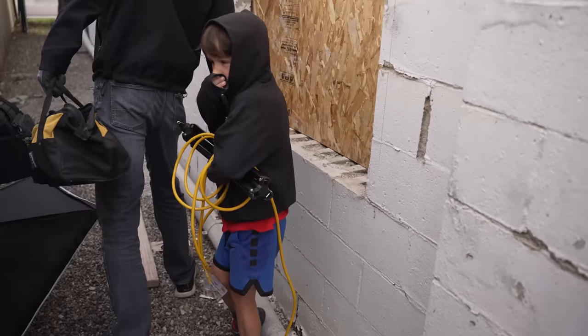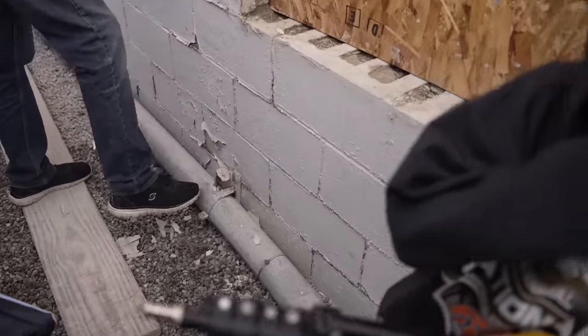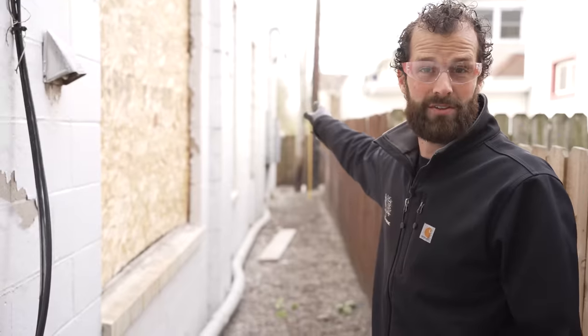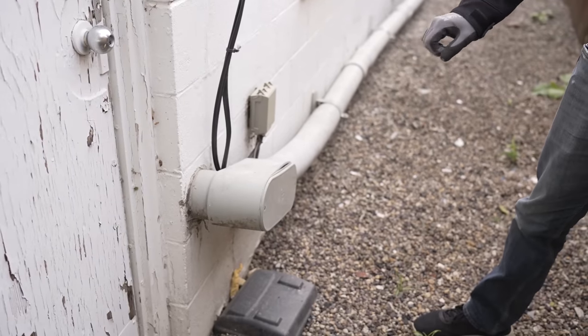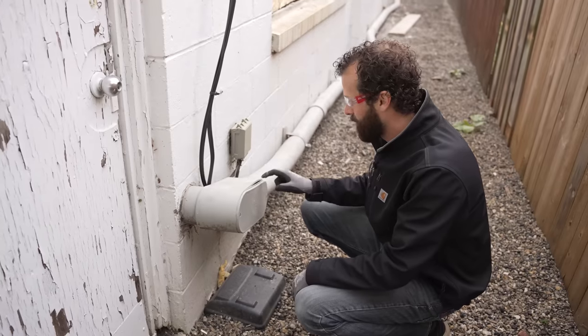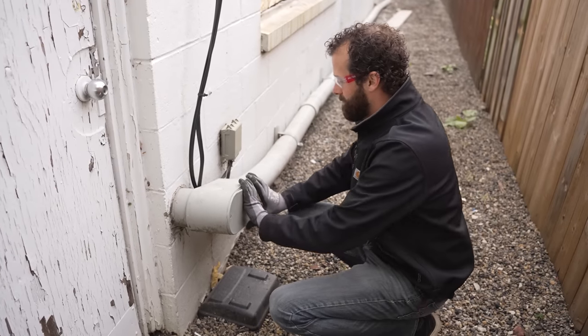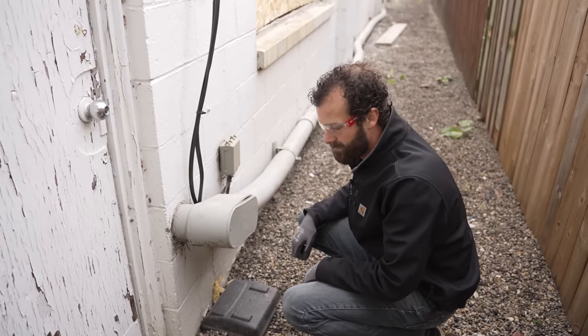Look, they had a tree growing up out of this. Put a lot of pressure on that conduit. Thankfully, it's been addressed. There's the meter down there. Conduit, here's the LB. Let's take a look inside. With a gap, I'm thinking rodent entry. It's got a gasket, but we just gotta close that up, so figure out why it's bulging.